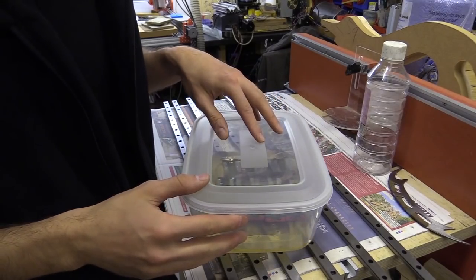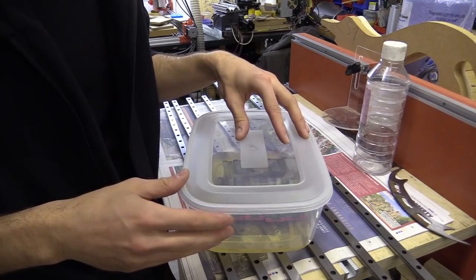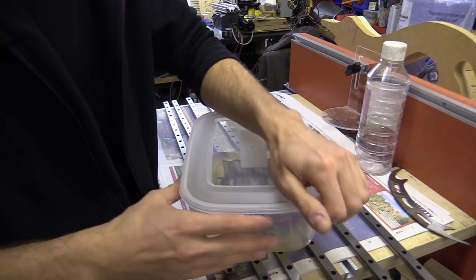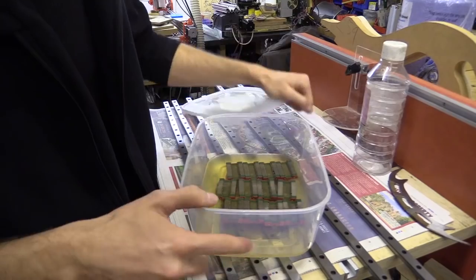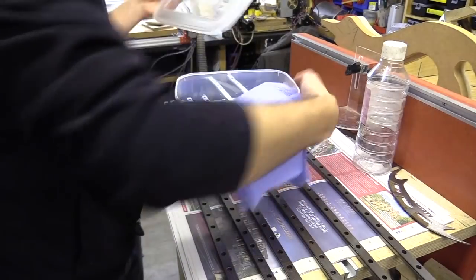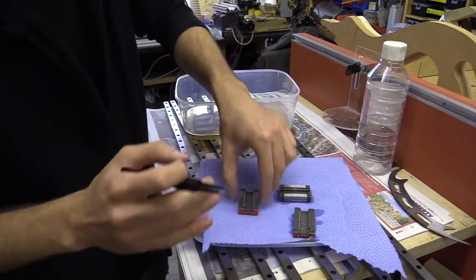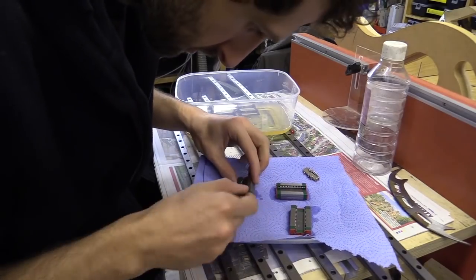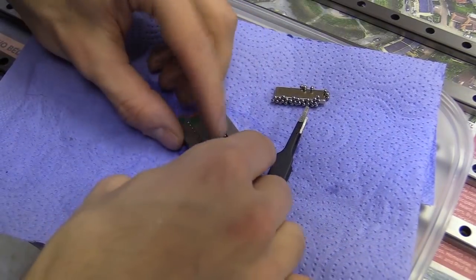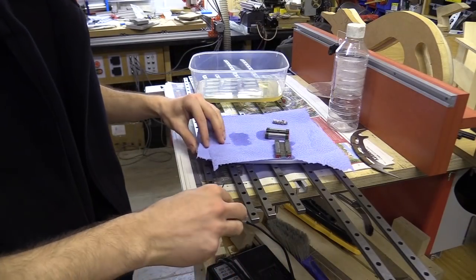This is what the methylated spirit looks like after the rail blocks have been in the solution for about 3 days. I painstakingly check each rail block, replace any lost bearings and place the blocks on the rails. If I don't think a particular block sounds or feels smooth, I carefully move that block to another rail, picking the best combination.